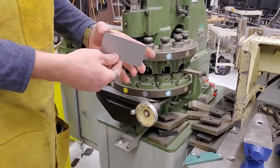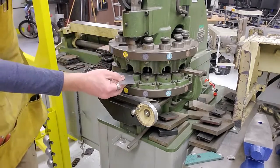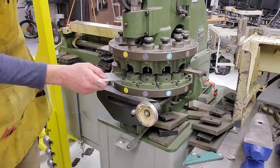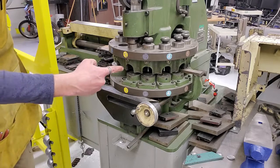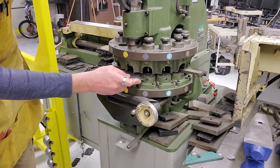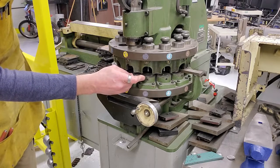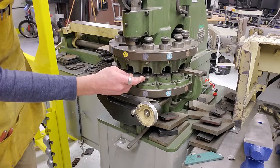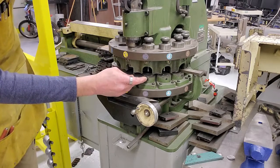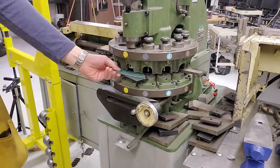We've got our coupon here with the dents. We're going to slide that in — as shown in the intro to this machine, the turret punch: if I lower the handle a bit you can see the punch moving up and down in there. I'm going to lower it down just a little bit, slide that in, and you might be able to hear it when I get it to the right spot. Did you hear it click in? I can feel that the point has dropped into the dent, so I know it's in the right place. Punch that hole.